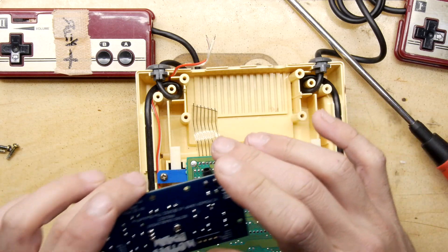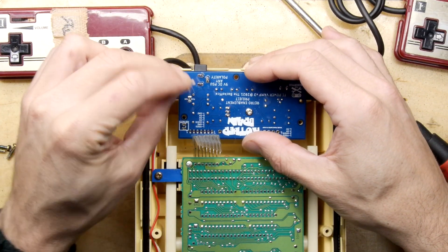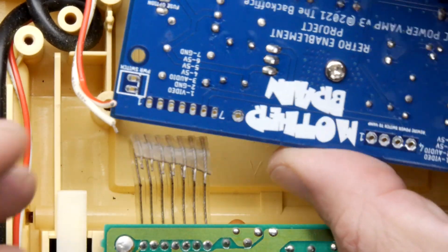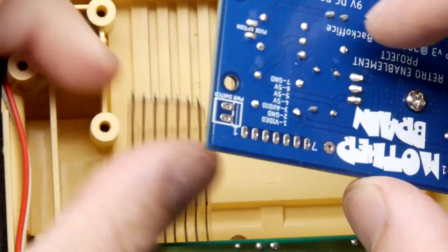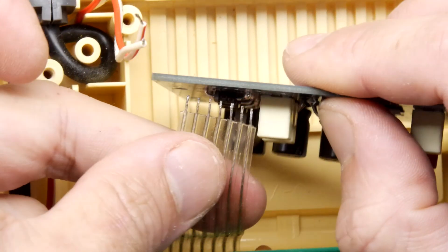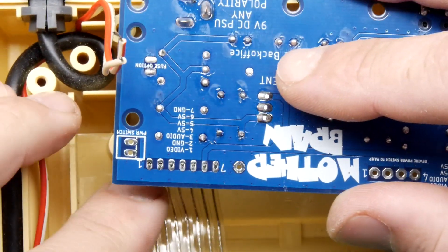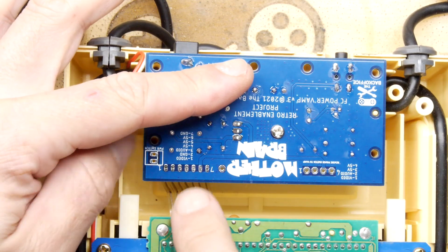Now you've got two options here and some people do either. So you can fit this like that and actually solder them from the top if you want. And instead of putting them through the holes, you can just lie them on the pins. So when you lie them on the pins, you have to solder them basically lying on the pins. But these are really nice and clean. So I'm going to do it the proper way. Let's keep the power lead out of the way for now. We're going to do that one from the top because it doesn't really need to go in the bottom. These will line up nicely, sliding them through. You should see them just starting to poke through.